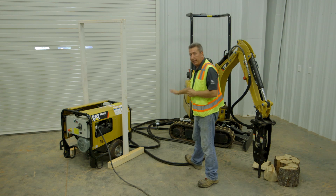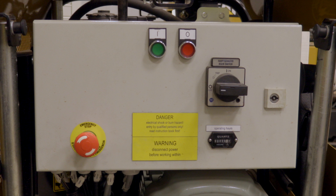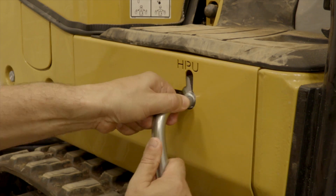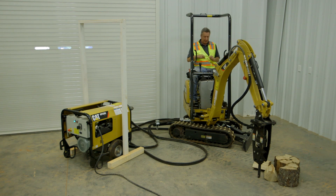The hydraulic hoses stay at that length. On this side of the machine you've got your controls — your master on/off and your trip. We're going to go ahead and turn that on. We have an emergency stop button on here, and then the green button to start it going. Three points of contact up into the machine — safety glasses on since we have a hammer on this machine — and of course our retractable seat belt. With the hydraulic motor running I do not need to turn the key on; I just need to put down my safety brace.